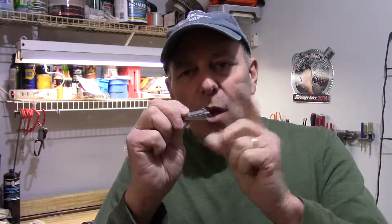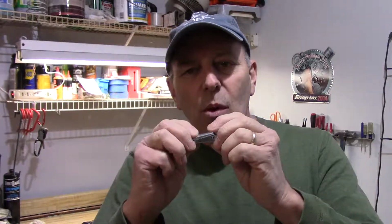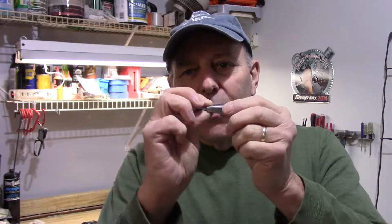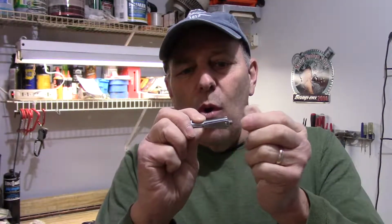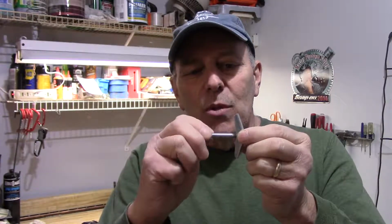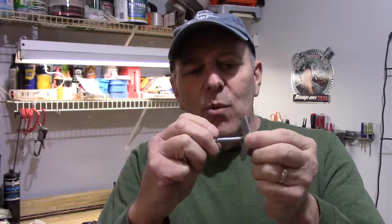What you do is you drill a hole in the wall, which I will demonstrate how it works. You're going to drill a hole in the drywall. You're going to take this, push it into the wall. When you push it in the wall, that's going to happen. It's going to pop open like that, and then you would just tighten this down, and it would pull tight against the wall, and therefore nothing can pull back off this.